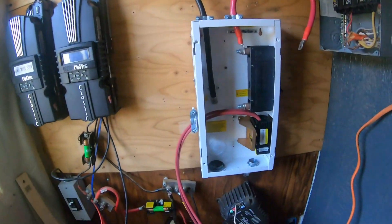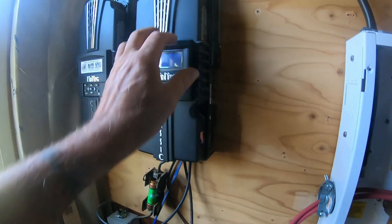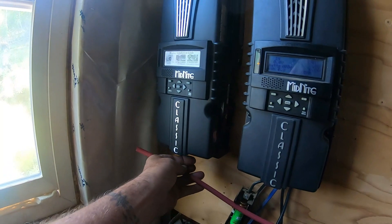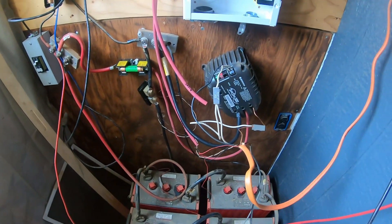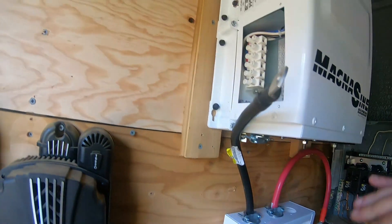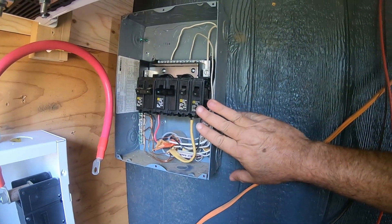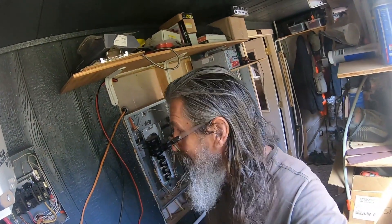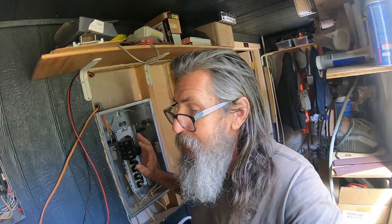Right now I am measuring what we need. These two breakers are going to be the disconnect for the charge controllers — the one on the right will be this wire, the one on the left will be this wire. It's a mess, it's scary. Then we've got a wire going up to wire the inverter to this breaker box and this breaker box. The inverter is going to two breaker boxes — not many people understand why I did it that way, but we'll get there.